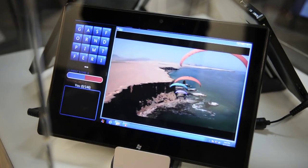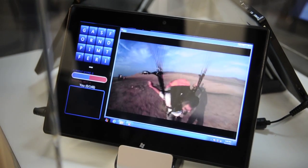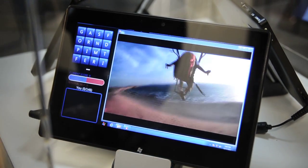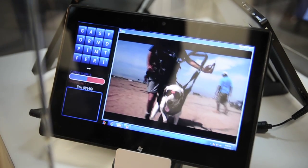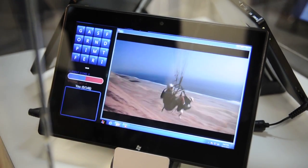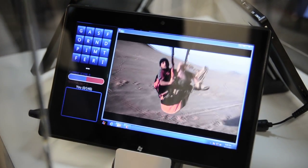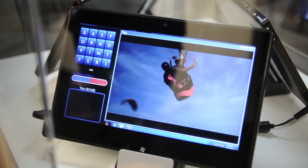As you can see, we are doing two applications with a split screen. We have a 1080p H.264 main profile video playing on the right side of the screen, and then we have a game that we can play. This video is completely accelerated in hardware, so it's not using the CPU or the GPU.